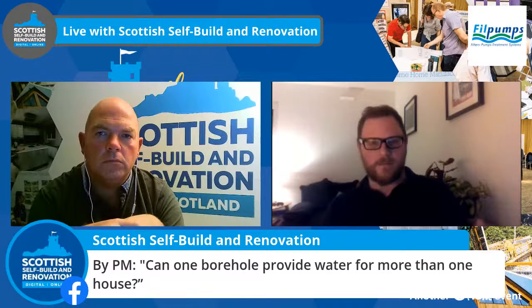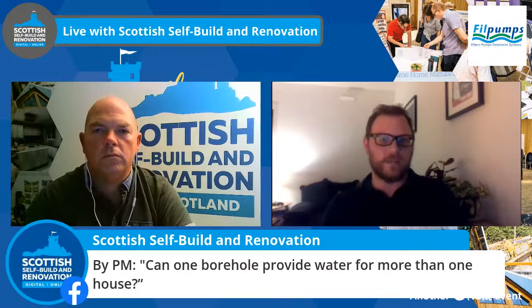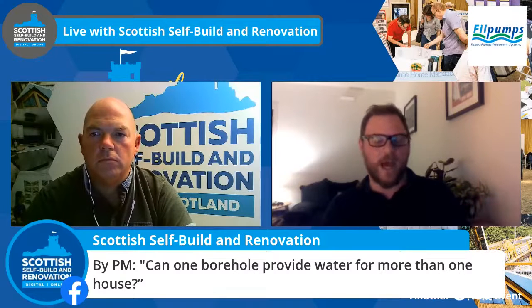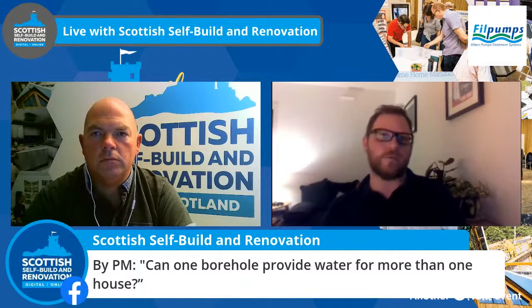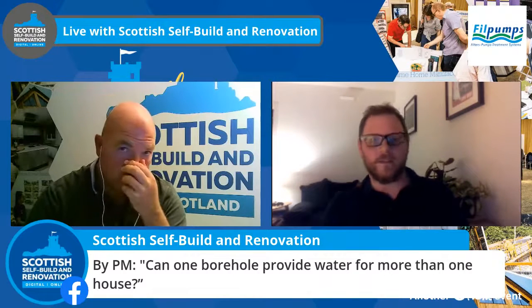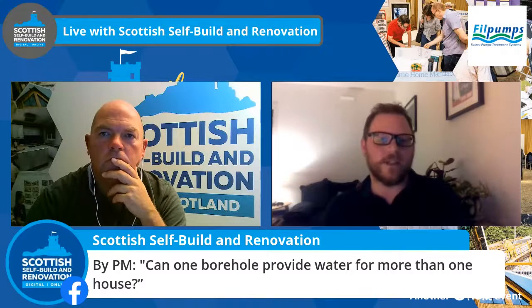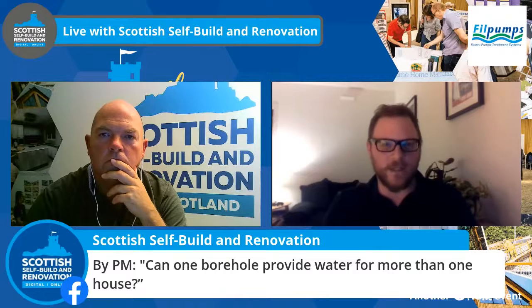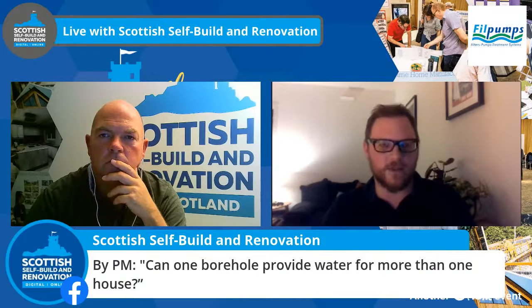So it might be that the borehole can't just be plugged directly into the house, but with a tank and a booster pump, even a big house is only going to use maybe about 1,500 litres of water a day maximum. And if you've got a borehole giving you 14, 20,000 litres in a 24-hour period, then yes, you can do 10, 12 houses very easily. So it's not a problem for boreholes at all. As long as we find a viable flow of water, it can do a lot of houses if need be.